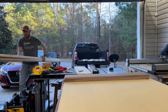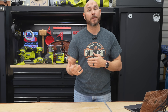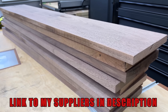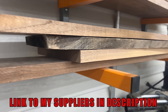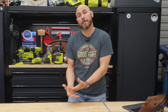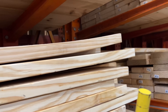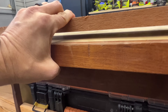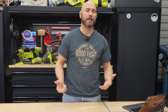If I go to my local store, pick out some lumber and bring it home and use it right away, theoretically it's going to be okay because I'm only a few miles away — same temperature, same humidity. But I do get hardwood shipped in, and those I absolutely let sit for a week or two, sometimes months. The reason you want it to acclimate is because of humidity and temperature change. If you use it right away, that wood may bow, bend, and split inside a project.